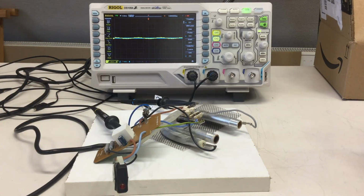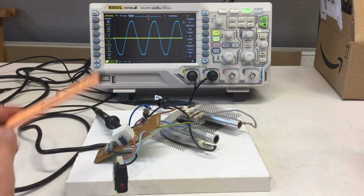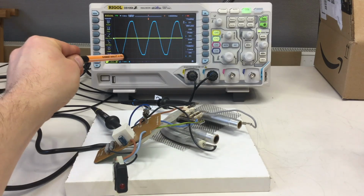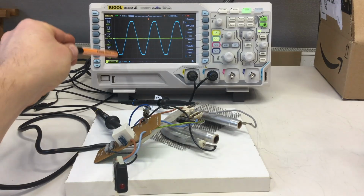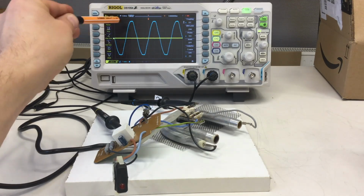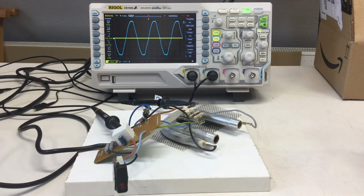Anyway, plugging that in the right way. Lights are still on, so no mistake. So here the blue line, I'm just measuring mains AC. 100 volts per division. You don't see the division raster, but it's 300 odd volts, or 600 odd volts peak to peak, which we have with our 230 volt mains. And the yellow line is connected, yeah, to the positive of the capacitor.